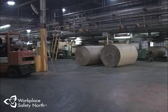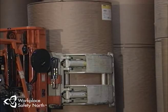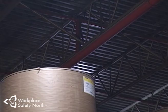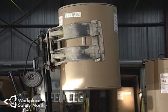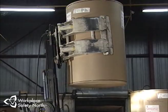Once the roll is picked up, drive the lift truck in reverse facing the direction of travel. Vertical loading or unloading from high stacks places extra demands on operators — the higher the load is lifted, the more unstable the vehicle becomes, and any sudden movements could topple the lift truck with disastrous consequences. Operators must also be aware of ceiling heights and the clearance above the top of the stack. These are typical situations that require safe operating habits day in and day out. Each plant or mill has its own unique set of hazards — it's your job to know those hazards and develop safe habits to prevent accidents.